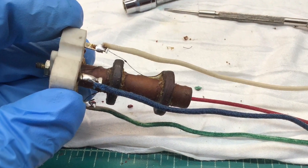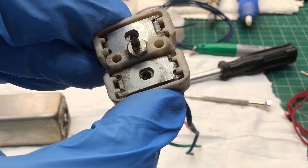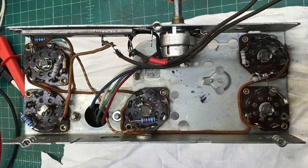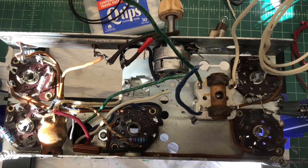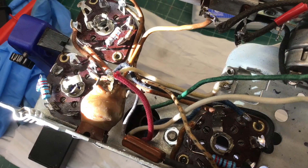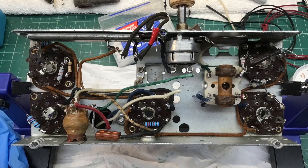Here I'm breaking down the IF transformers and rewiring those, cleaning up the capacitor areas as best I could. You can see all new resistors in place, placed back where they were originally — hopefully that will help me with the wire dressing when it comes time for rewiring. Getting the oscillator coil back in place and wired up. For this receiver, I used an electronic copy of the schematic, color-coded as I'm doing component replacements and individual wiring.